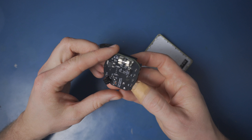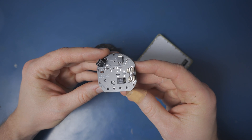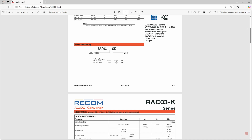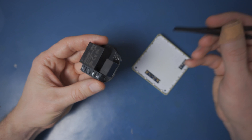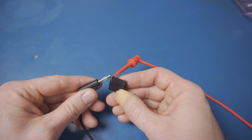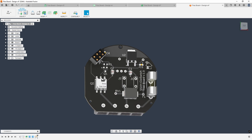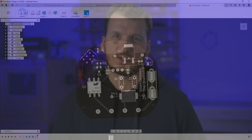The mains version has extra safety measures like a varistor and a fuse to protect against potential failures. Additionally, the AC-DC converter I selected is equipped with built-in protections including overload, over-voltage, and short-circuit safeguards. The main switching component is a relay — it handles high current, can switch both DC and AC, and has low resistance so it doesn't heat up much. On the downside it makes a click when it switches, has limited mechanical life, and is quite slow, which means you can't use it to dim lights. However, a triac board is already in production — a triac is perfect for dimming lights, assuming your bulb is compatible — so an upgrade is on the way.